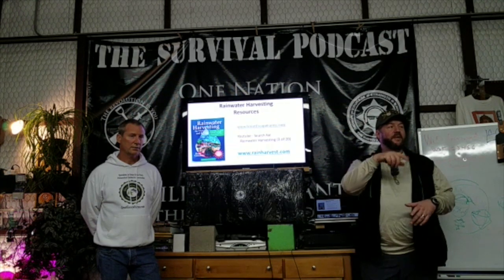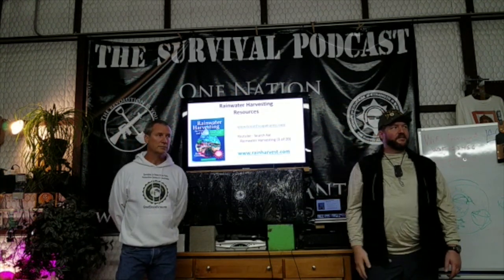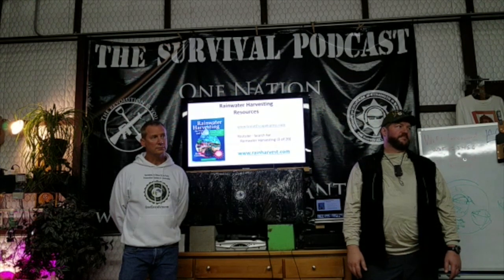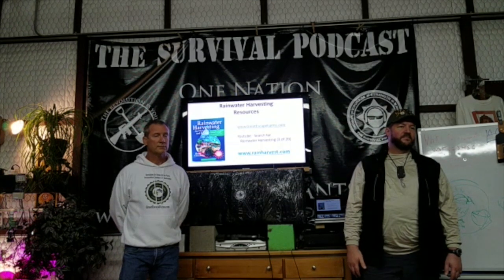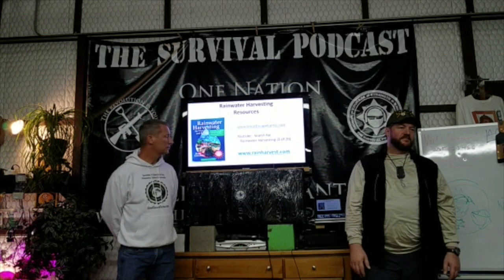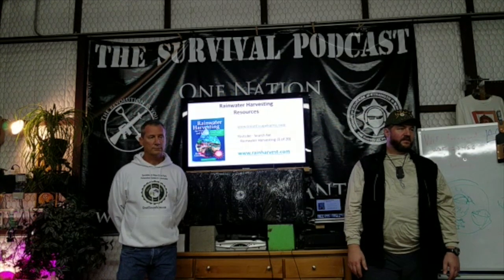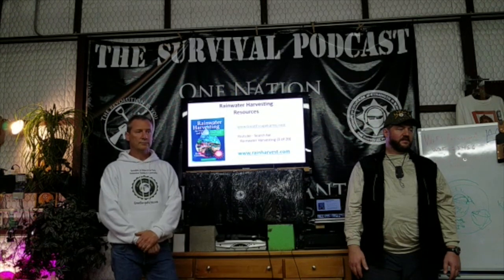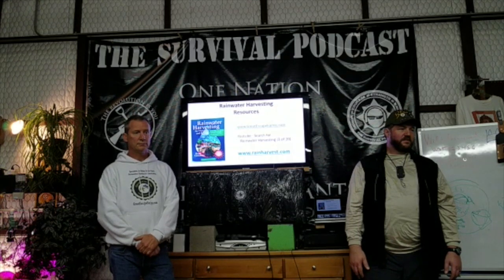No, yeah, that's what I mean. I've got that exact same situation at my house, and what we did was when you come off the gutter, 45 it, you bring it past 45 back down. That's what I was wondering if that would be the most efficient way to do it. And if you're worried about it getting plugged, just go bigger in that section. What I did is I just ran a 3-inch pipe all the way to the ground, put a T on the ground, sitting on a cinder block, and it's got a cleanout plug. So that's basically my first flush for that side of the house.